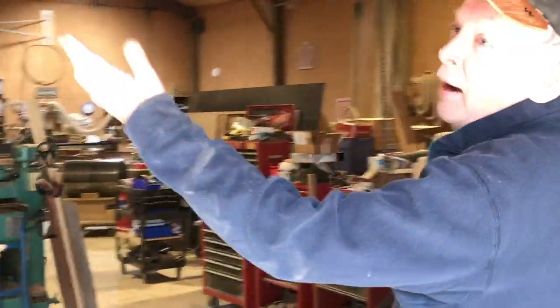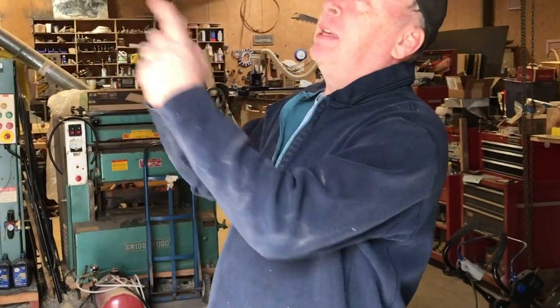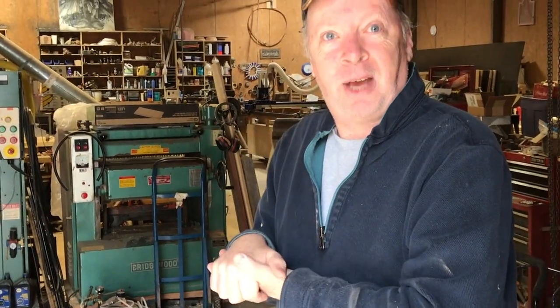So we come in. I made this with some of my high school hockey kids and my nephews. My nephews were this big when they came and helped. So I built this myself, and Mr. Horgan helped me with this construction company. The building is stressed skin panels. So they are 6 inches of styrofoam in the walls. So this is as energy efficient as a walk-in cooler. It costs more to heat the house than it does to heat the shop.